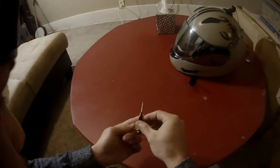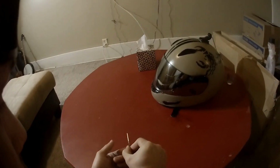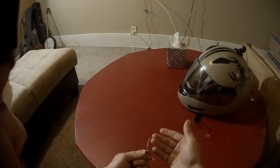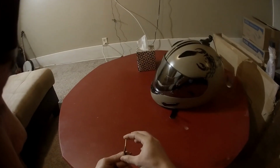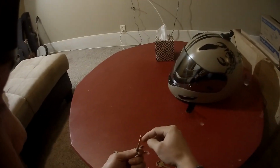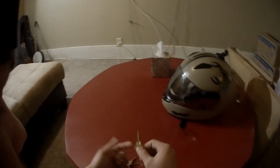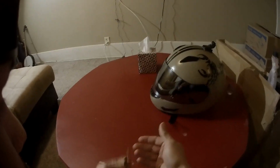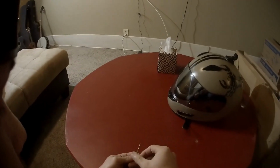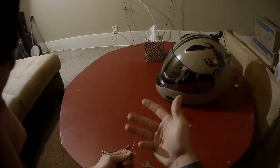In essence, you stick the key into the lock, create a small amount of tension. So right now, you've stuck the key in about 95% of the way. So all the pins are still hanging down in between. Create a small amount of tension. Hit it with a blunt force object, a small mallet, back of a screwdriver. It shocks all those pins back up into place, but because of the torque you're putting on it, it creates the right amount of friction, and they fall kind of back into their set heights, allowing you to turn it.